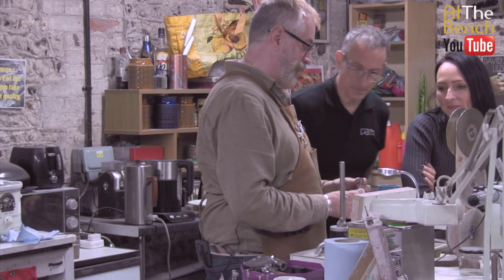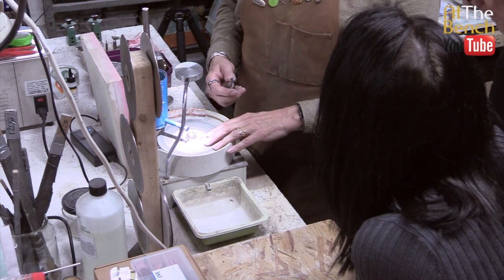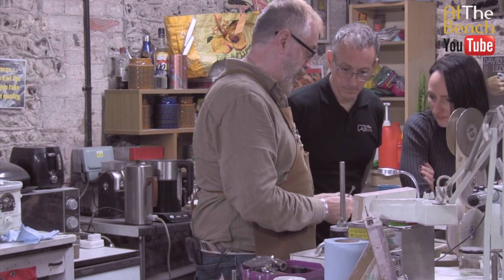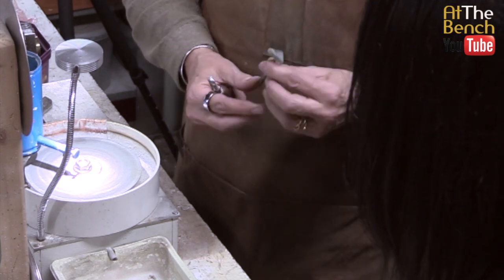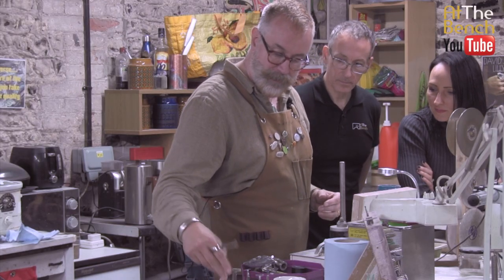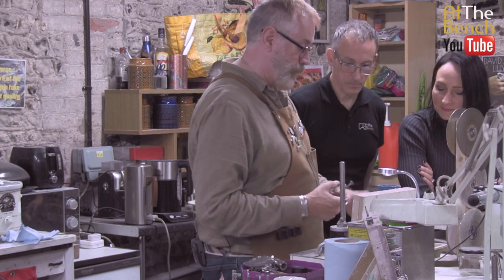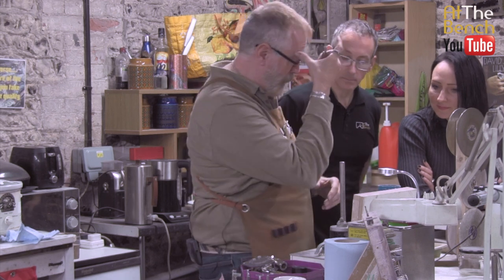Because we've got a boulder opal, it's a fairly soft gem, so I'm starting with a 600-grit lap. Depending on the gem you have - if I was cutting this piece of moss agate, I would start with an 80 to get the shape I want, because moss agate is much harder than boulder opal. Then you go through the different grades of lapidary wheel down to 3000-grit, and then take it onto the polishing wheels. Some people finish it on the laps, but the way I was taught, we get that far and then move onto the wheels with paste.